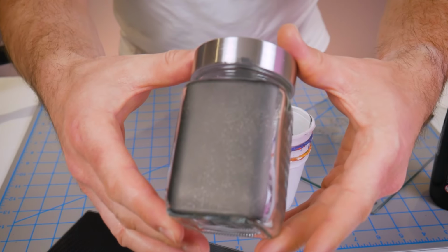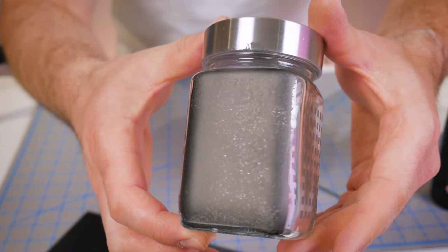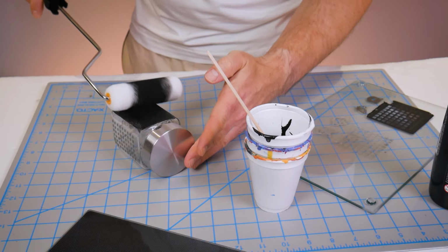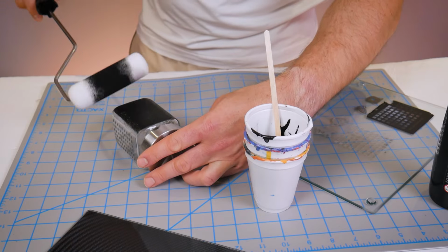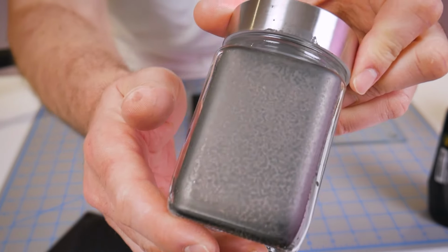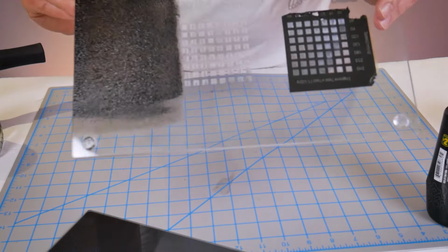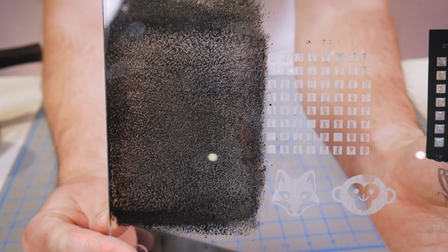But after a few tries, I'm realizing that this is just impossible and it's not the case. Similar to the chalk marker and other water-based paints and coatings, the first coat never adheres strong enough even after it's completely dry, that as soon as you apply a second coat, the water inside of the paint seems to wash away the first coating and you can't build it up.